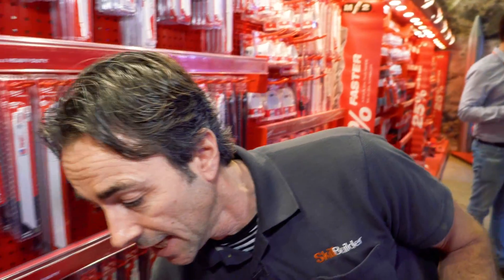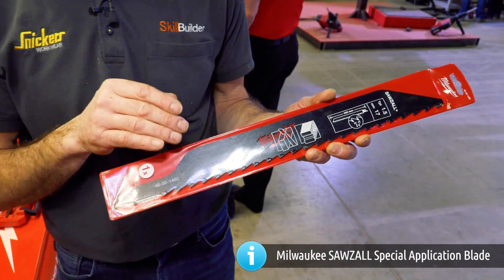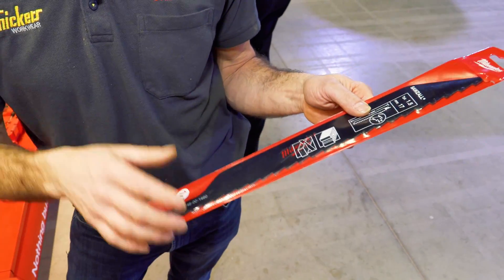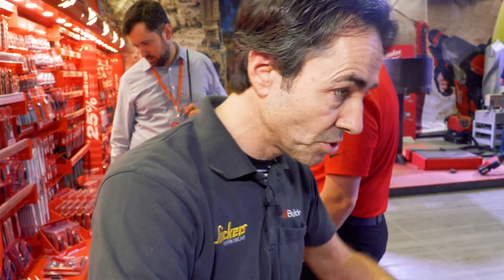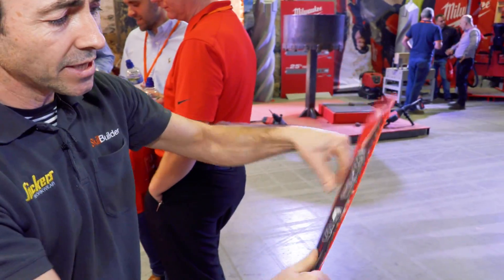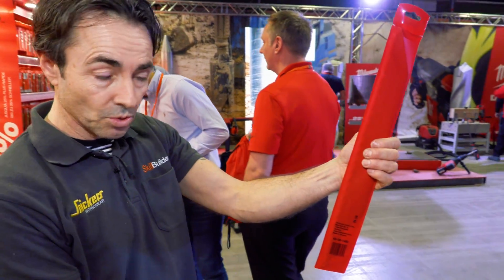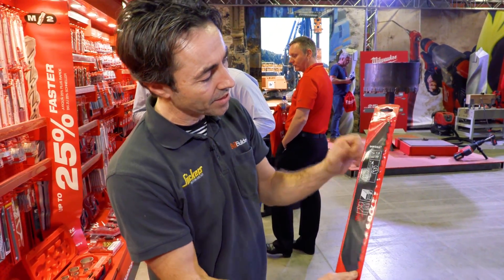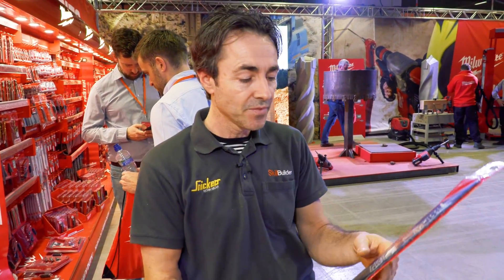The last blade I want to show you is suitable for lightweight blocks and I'm going to give it a go on PIR board. I've got an idea where I want to set up a reciprocating Sawzall saw in a frame and pass my PIR boards over the top. The blade is nice and stiff so it won't flex in thick PIR. With a timber fence on a bench I'll be able to do lots of repeat cuts, and it will give me the depth I need for 120mm PIR.